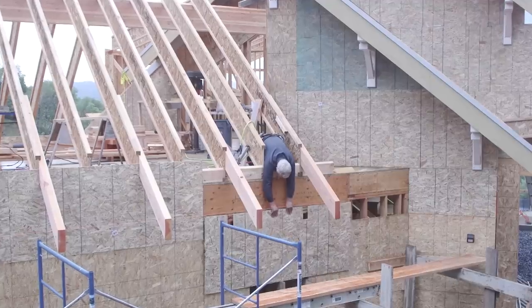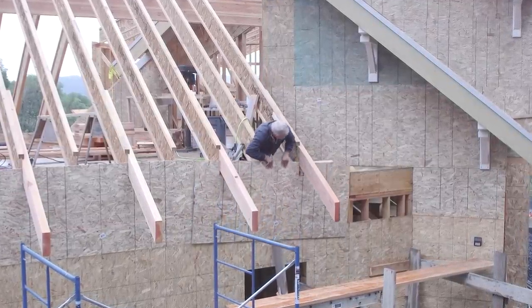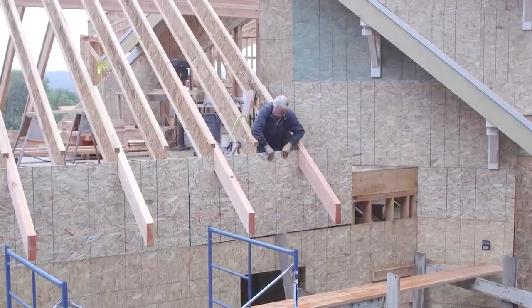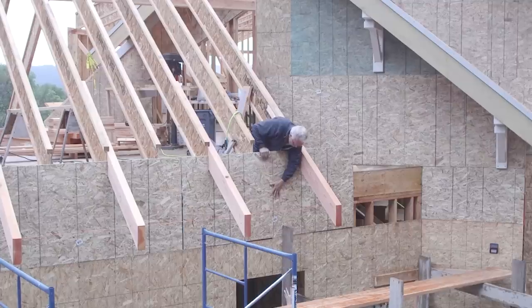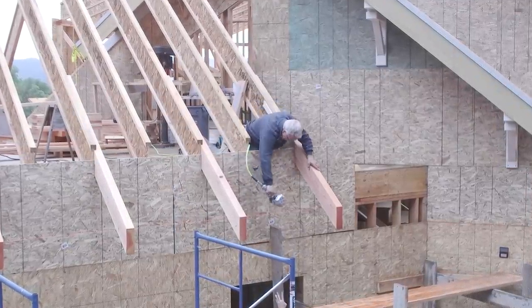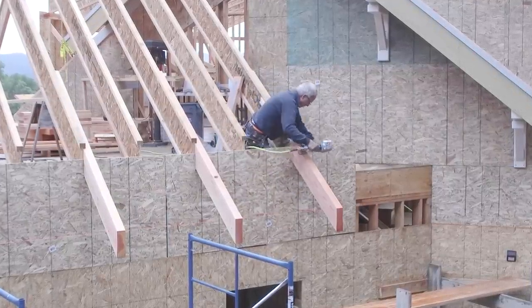You can see right here how the wall sheathing lays over the top of these shear blocks and ties the roof to the second floor deck and our rim board clear down to the first floor, securing everything together. Remember those screws that we ran through the rafters? They were great and they did their job — but this OSB is what is actually holding the roof on the house.